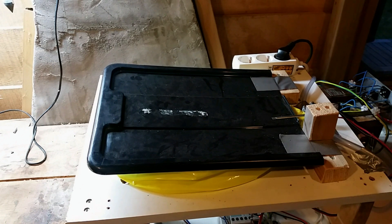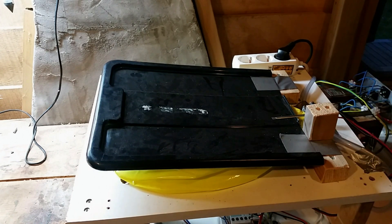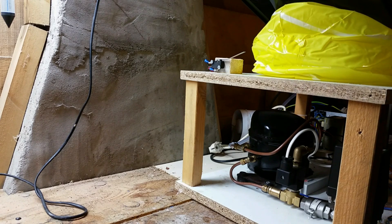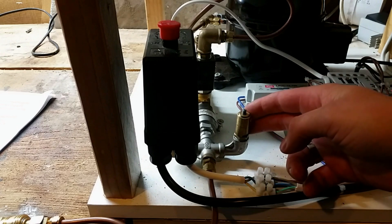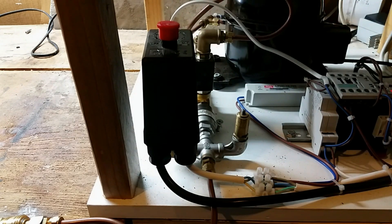The buffering bag is filled with hydrogen by the generator. When it is full, the plate on top of the bag triggers the micro switch, which powers the compressor relay. The problem with refrigerator compressors is they won't start if there's a little pressure on their outlet. To solve that, I added a three-way valve and a timer relay so it pumps to its own inlet for the first four seconds. After that, the timer relay switches the three-way valve and it starts pumping gas into the tank — so you don't lose any gas. When the buffering bag is pumped empty, the other micro switch turns off the pump. The pressure relief valve is for obvious reasons. I also added a pressure switch — all the electricity runs through this switch — so if the desired pressure of 12.5 bar is reached, the generator and pump will be shut down.